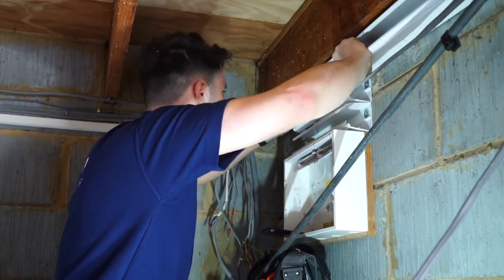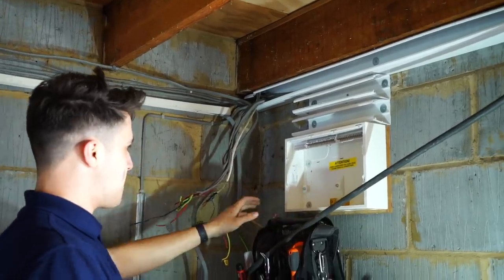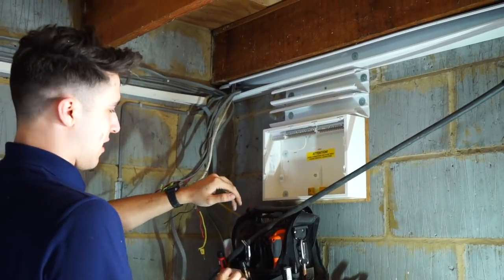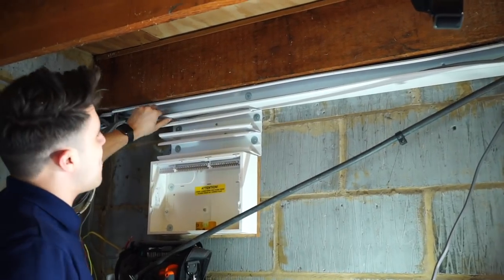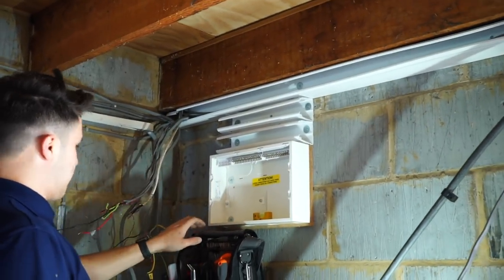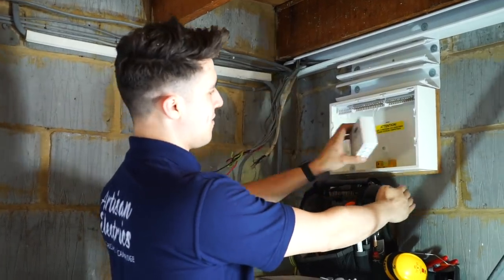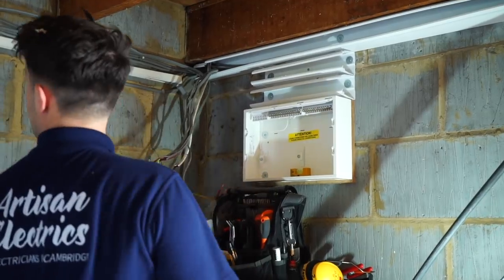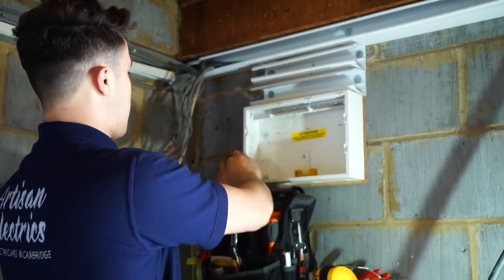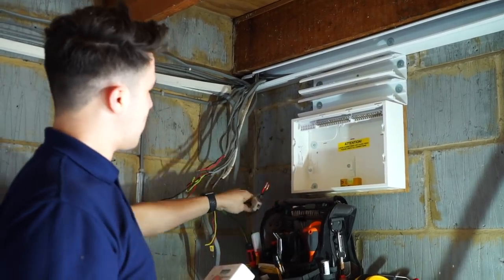The plan is I'm going to lid up this trunking and cut it so it's one nice solid hunk. I've managed to get all the cables in there. The plan is to have everything inside this trunking because I didn't like all that cable nonsense at the top. For the meter, I need to get an electricity meter on just to monitor what the annex is using. I'm going to put a piece of trunking underneath, maybe come into it and run trunking around. I kind of like the idea of having a piece of trunking butted up, running right up to the wall, bring the cable inside a piece of pipe into the top, loop out, and put proper tails in rather than 10mm.